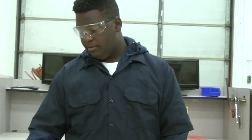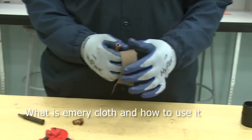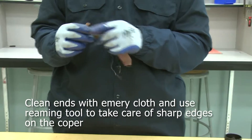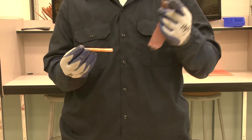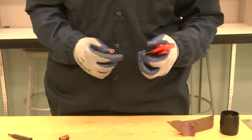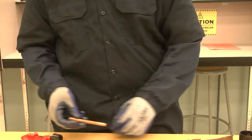When you're finished cutting a pipe you're going to want to smooth it out and get rid of the burrs. You can use a burr tool, a reaming tool, or emery cloth. Emery cloth has the same consistency as sandpaper — fold it at the end, get it in there and go around. What you're doing is getting rid of all the excess and the burrs and making sure it's clean on the inside. Give it a little blow to make sure there's no excess copper dust — you don't want that inside your pipe. Then take the deburr tool and go around one more time just to make sure there's nothing excess left.